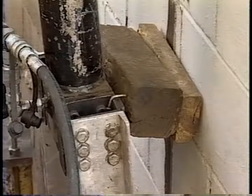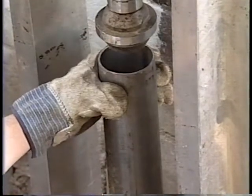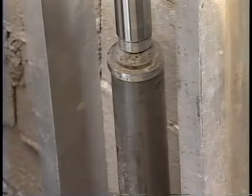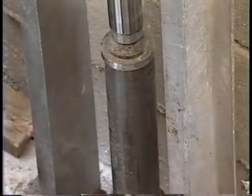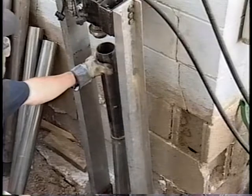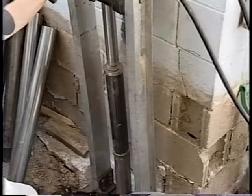Now that you have the five-degree angle and the bracing in place, push the drive cylinder down until it bottoms out. Once the cylinder bottoms out, let off the pendant switch so that the bracket remains tight against the footing. Using a hammer, drive the wood cribbing tight against the bottom of the bracket — this may require additional cribbing. Once the cribbing is tight, put the pump in the retraction position and using the pendant switch, retract the drive cylinder to its original position. Place the grip-tight driving tube, commonly called the shorty, onto the starter tube, then use the drive cylinder to push the remainder of the starter tube into the ground.